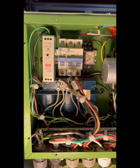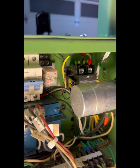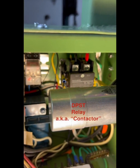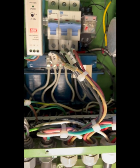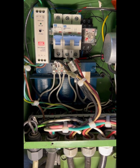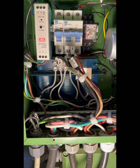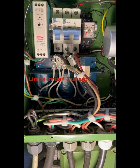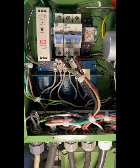240-volt mains comes in via that double-pole breaker, and that feeds a 220-volt relay in the back there — that is what's actually feeding the VFD. It goes up through the column on top of the cabinet and up to the VFD, then three-phase coming out comes down the same way and into that blue reactor in the back. That's an inductive reactor — basically three ferrous core inductors all linked together on the same core — used with induction motors as a filter to limit inrush current to the field windings. I felt that was important since I'm retrofitting this old motor and asking it to do something it was never meant to do originally.